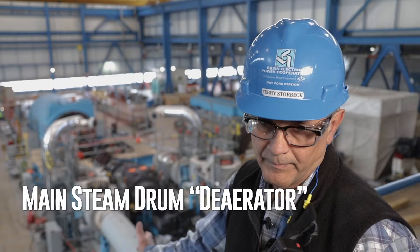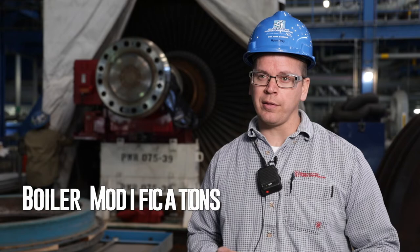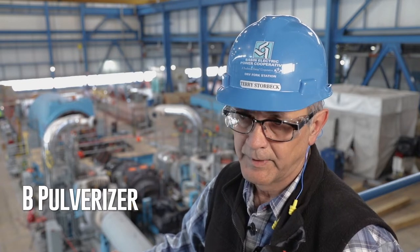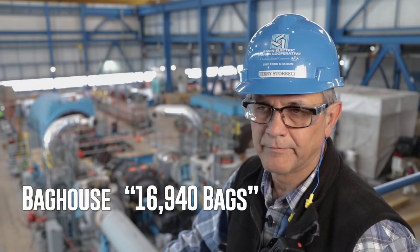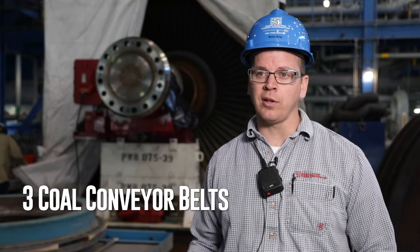This is eight years into our production run, so right now we're at a spot where we're digging into all the major equipment. We've got the turbine exposed, the boiler feed pump, spare part inspections on the main steam drum and deaerator. We're into the boiler replacing all our platen superheat tubes, doing all critical safety valve work, redoing all modifications, reworking SCR designs, doing a major on the B pulverizer — first time we've changed roll wheels out. We're replacing bags in the baghouse — all 16,940 — replacing venturis in the scrubber, adding air cannons and sonic horns, and getting new belts on all three coal conveyors. We're doing an awful lot, so pretty busy.